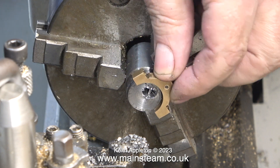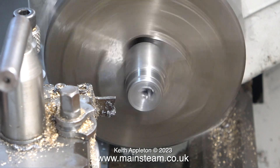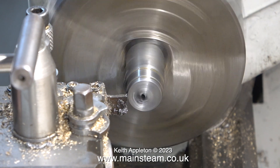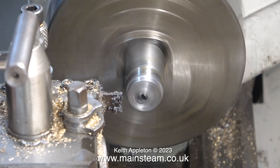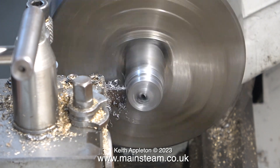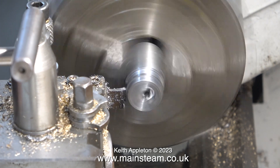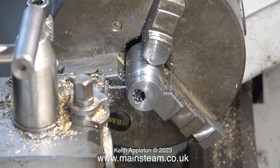This is still a part of the comedy of errors. In this clip I'm making sure that the external diameter of the piece of steel matches the eccentric strap, and it does. After double checking the diameter I'm now machining the other side of the part that sticks out. I find this a really weird way of making eccentrics — it's not really necessary but it's like full size practice. It holds the straps onto the sheaves quite easily.